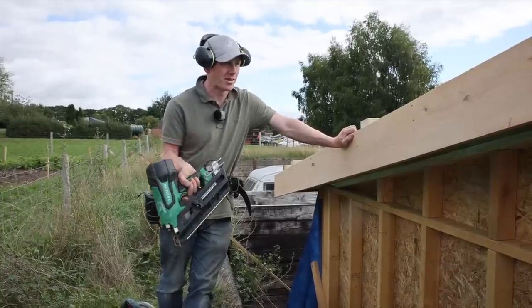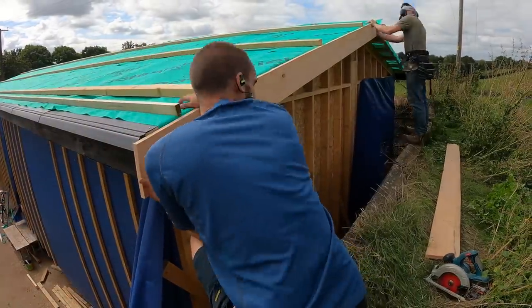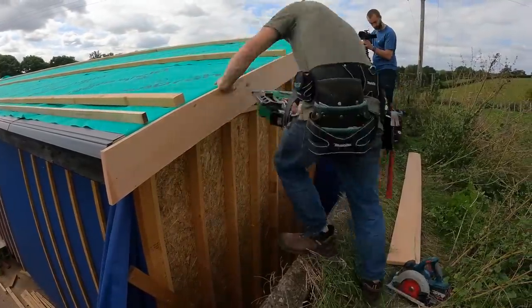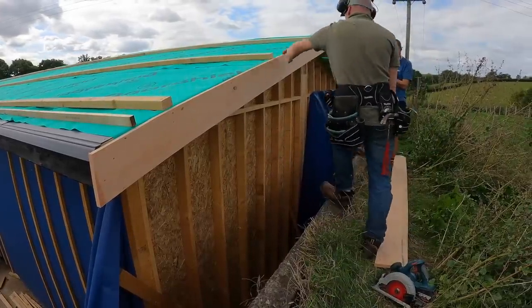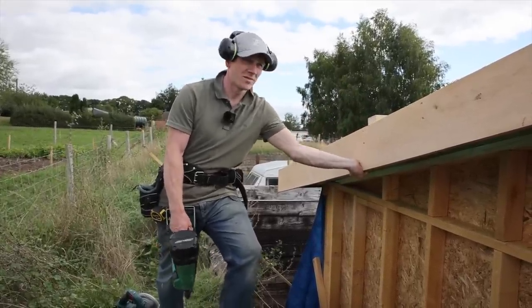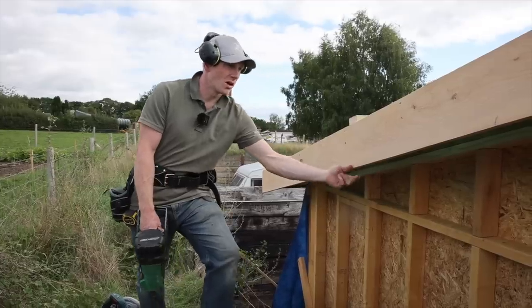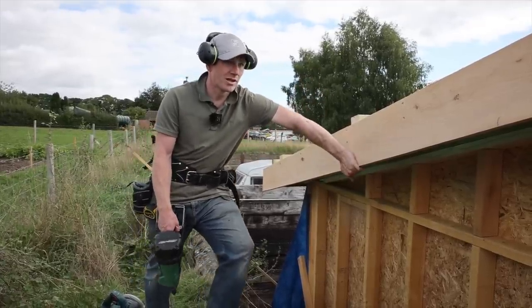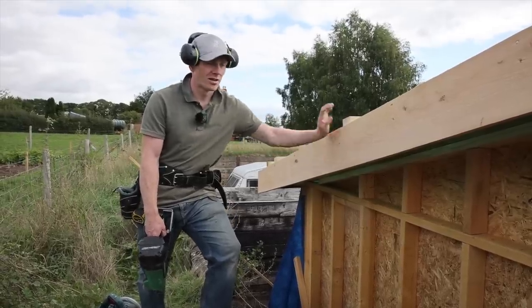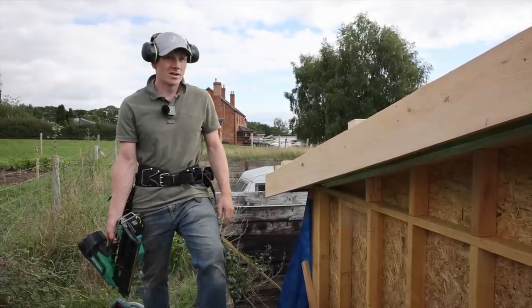Those were the stainless steel nails - 65mm, which gives them about 45-50mm into the timber behind, so it's anchored nice and strong. They're every 600mm. The only thing is, because we're going into quite a small timber - 75mm kind of sub-timber - the bottom 100mm or so is a little bit exposed. One option is therefore to put a feature block halfway, a bit like a purlin showing, and that might just pull it in. We've got another one at the bottom and could do another one at the top just to avoid any chance of these twisting - they're pretty dry but they were green timber when I bought them. One side to go and then we are onto the roof.